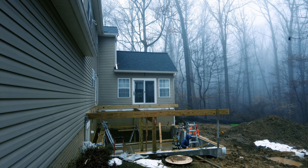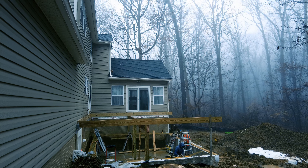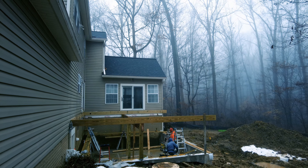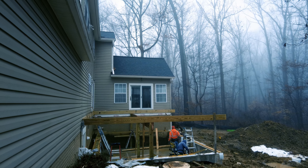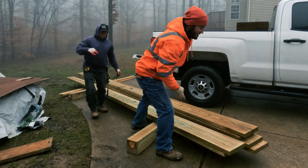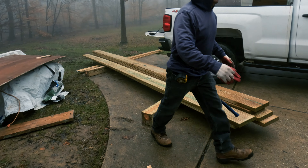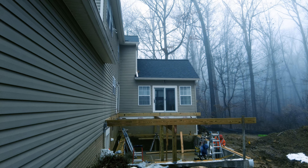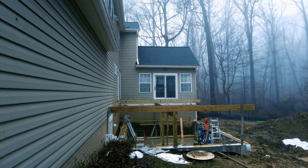Here's the update — I'll give you the Cliff Notes version. For some reason, our deck protrudes out to that outside corner of the existing sunroom — I'm like 19 feet 8 inches or something goofy like that. So I don't know why I did this, but I got all 12-footers and I was going to split them on the beam. So you'd have 12-footers out from the house to the center beam and then another 12-foot 2x10 out to the end of the screened room.